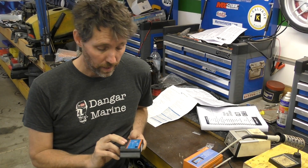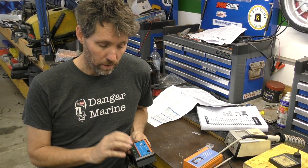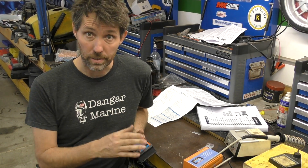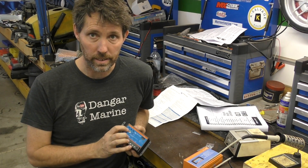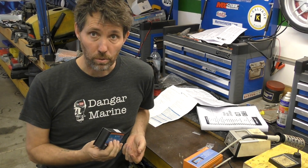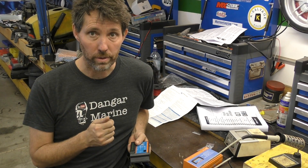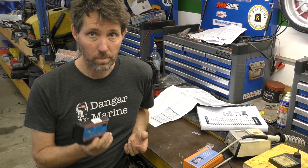This wasn't very expensive - it was about $40 - and it gives you some information and protection. It protects the battery from being overcharged, which is the primary purpose. It also has the facility to hook your loads up to the controller and it'll disconnect those loads if the battery voltage is getting too low, protecting the battery from being over-discharged as well as overcharged. It gives you an LED indicator as to whether it's receiving current from the solar cell, so if it's a sunny day and that LED's out you know something's wrong with your setup. It also monitors battery health, and if you have your devices hooked up it'll let you know whether you're drawing current or if it's disconnected due to an overdraw - it acts as a little bit of a circuit breaker as well. Quite a bit of functionality for $40.